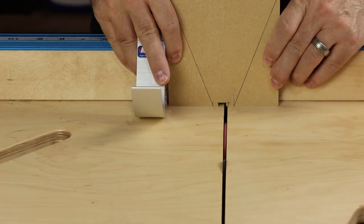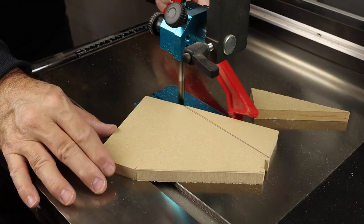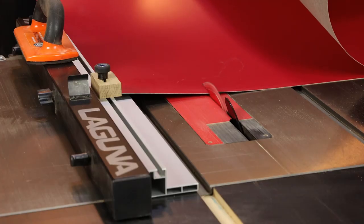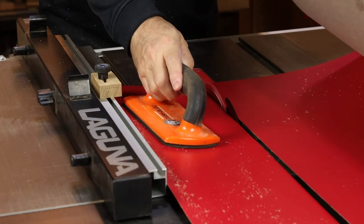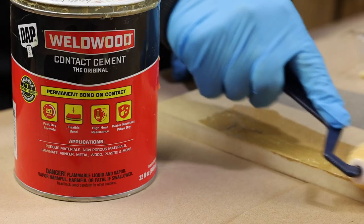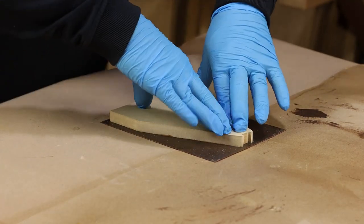I made a notch that was a half inch wide to accommodate quarter, three-eighths, or half inch bandsaw blades. For cutting plastic laminate at the table saw, you can put the high-low fence in the low position and add a little T-track stop block to keep the edge from lifting up. Then it's just a matter of using contact cement to secure the plastic laminate to the half-inch MDF, and finally trim off the excess laminate with a quarter-inch spiral down-cut bit.